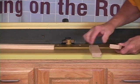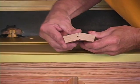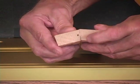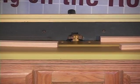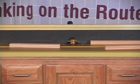Okay. What we're getting here, we're getting a good sharp edge, but you can see our tongue isn't quite fitting into our groove enough. See, we've got to get that tongue a little bit more exposed. So you'll find out when you use the tongue cutter with this set, you're going to have to move that fence back just a little bit more to allow for cutting that tongue.